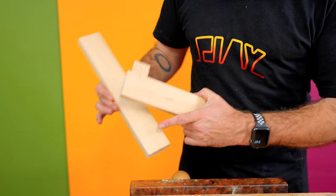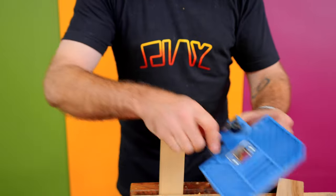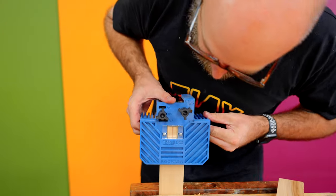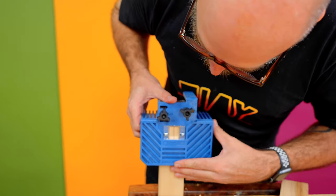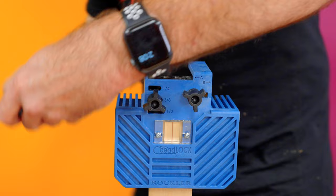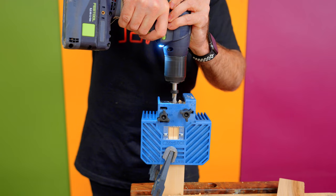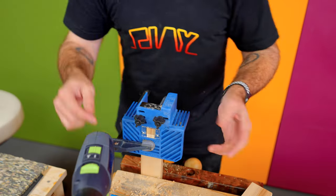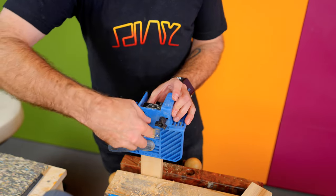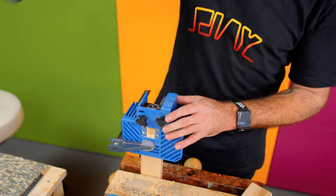So now we've got to do the same thing on this piece, except we have to go into the end grain. I'll throw this into my vise, clamp that down, move the jig back to position A, tighten that down, and throw this on there again. I'm lining up that sight line with my pencil mark, and then I can take a clamp, clamp this down and repeat. So we have those three holes drilled, then loosen that, move to position B, tighten that down, and drill our final two holes.